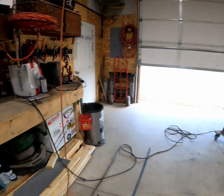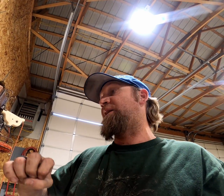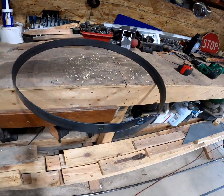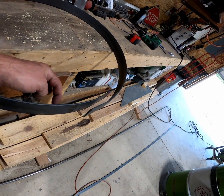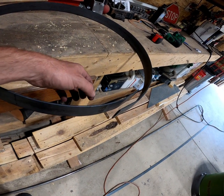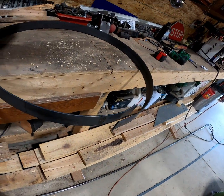I was originally gonna make this thing super fancy, you guys. Not gonna lie, I had all sorts of great ideas, but then I was like, literally, I'm gonna be plazzing on this thing, and it's gonna ruin all these fins anyways. Someday, I'm gonna go the simple route, you guys. I need to get this thing done so I can start using it. I'm gonna probably just tack weld my grate going this way across on top and bottom. Maybe a little extra weld on the top. As they wear out, I can just cut my tacks and put new ones in.